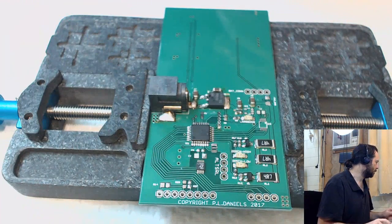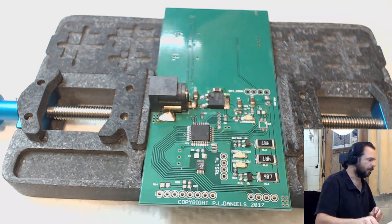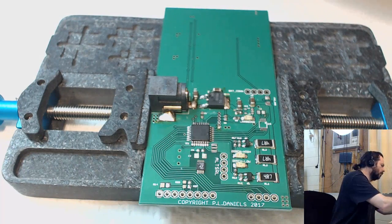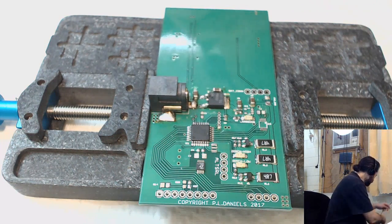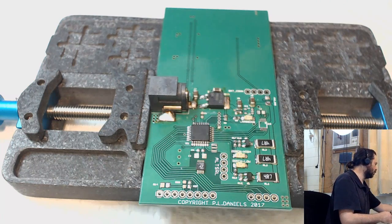because the poor little charge chip uses a linear regulator in it, so when it's dropping from 5 volt down to maybe 3 volt, wherever it's trying to start from charging, the heat's too much and it will just cook that poor little chip. So we limit it to 600 milliamp and it should do just fine.